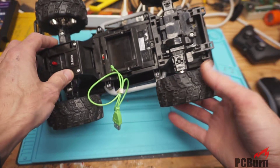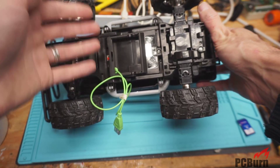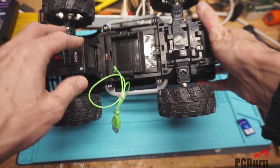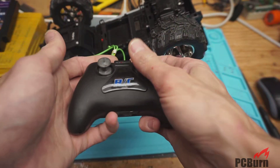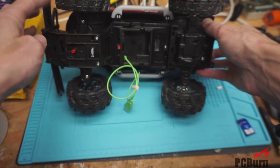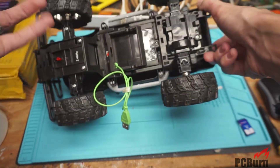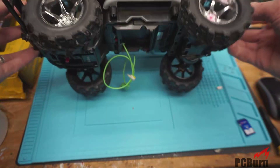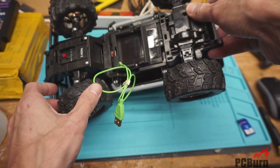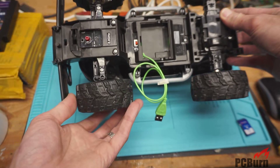I want something quickly and custom made that I can just swap out — hook up the servo motor driving the front and the DC motor driving the back, and add in a standard ESP8266 or Arduino remote control, so you can control the car with a little better accuracy. The controllers on these tend to have just an up-down on both ends for left-right and forward-backwards, with no granularity on the motor controls. It would probably be fairly fun to use with a variable speed controller and finer-grained left-right steering — possibly an improvement to the rack, but maybe not. It might be perfectly fine.